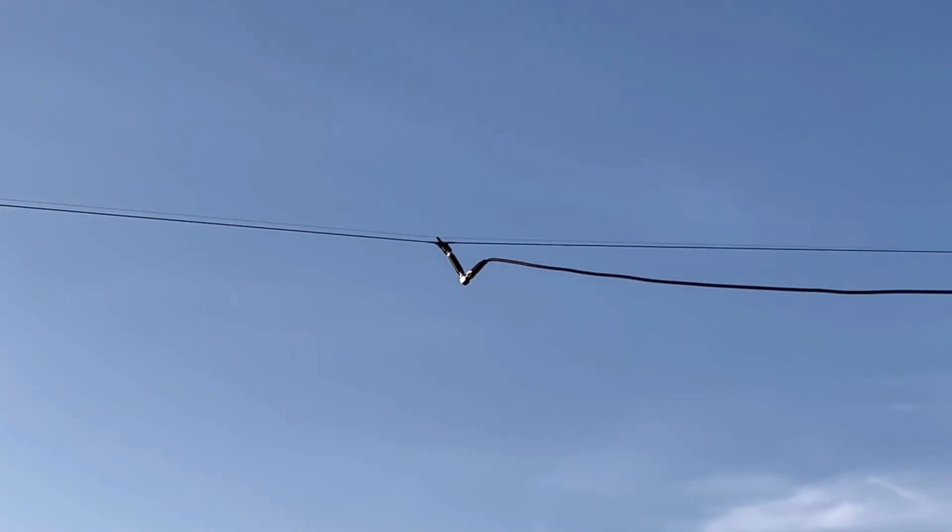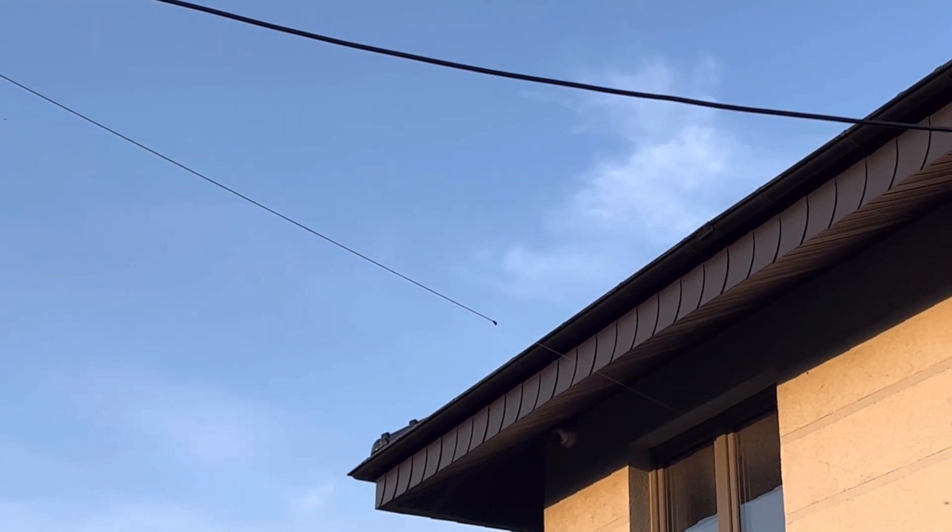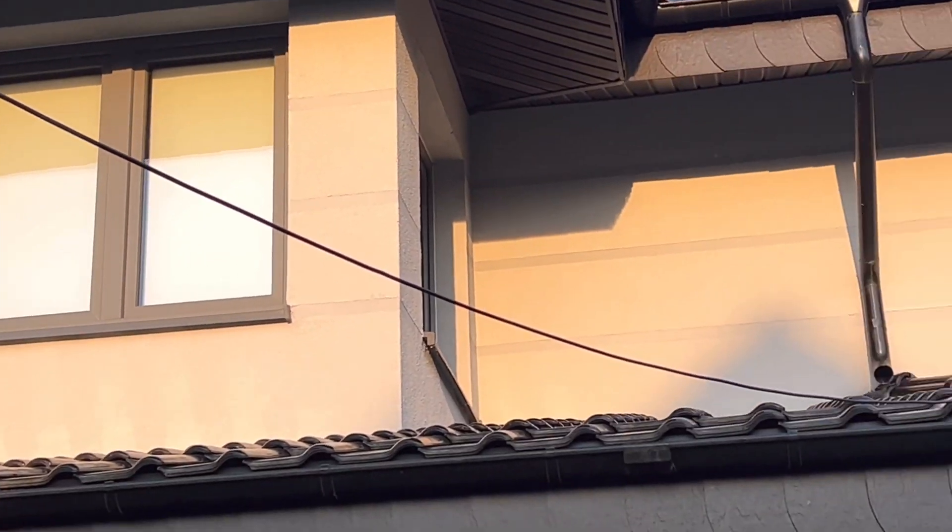Let me preface this by saying I'm not claiming a vertical is better than a horizontal or vice versa. It really depends on your situation and what you want it for. Let's go over a few basic antennas. If you're going to start out portable on HF, starting with horizontal antennas, the number one horizontal antenna — the easiest to build, basically the granddaddy of them all — is the basic dipole. It's simple, a half-wave long, fed in the middle.